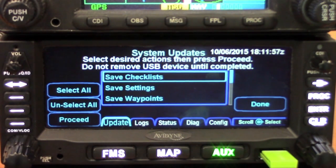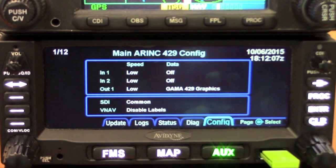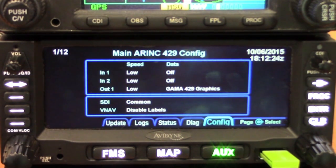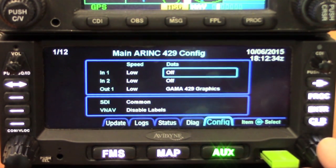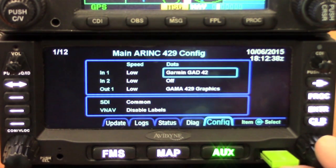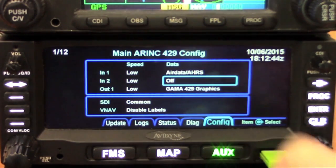Here we are in maintenance mode. You can use the aux button — it's a two-way rocker — and move across to the configuration tab, or you can just touch the tab to jump right to it. Here are your ARINC 429 configuration ports. When you installed your 430 originally, you had to configure it for 429 and 232s. We've intentionally laid out these pages identically to the 430 so it's very familiar. Push the button to turn the cursor on and change the data within the field, whether you have a high-speed or low-speed bus, selecting the appropriate device. Move down through the list of input ports and also output ports.